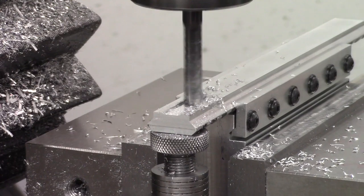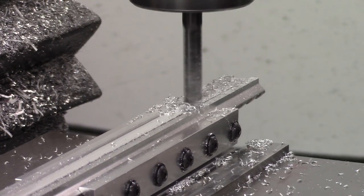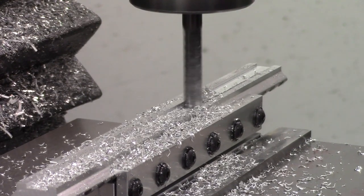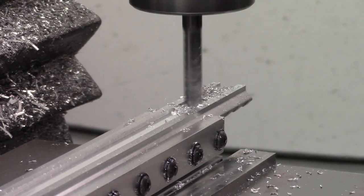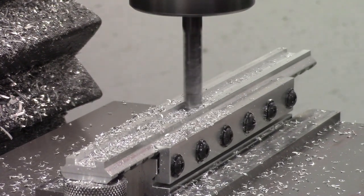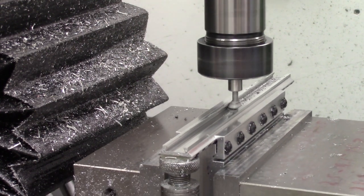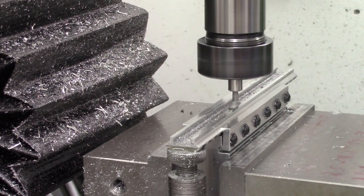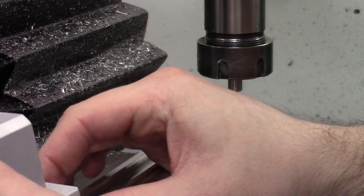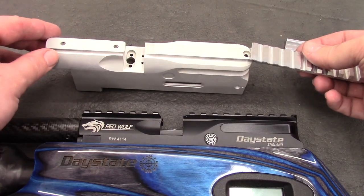Back on with the build — once the pick rail's to height we've got to mill a slot out for the dovetail to go in. This slot corresponds to the smallest part of the dovetail and we're going to be using a 60 degree dovetail cutter just to go along the sides cutting out the dovetail to the right width. Since we've got the block we're just going to be checking the fit of the dovetail against the block. You can measure dovetails using pin gauges and such, but since we've got the block it's quite easy to check the fit against the dovetail directly. So the first operation is to take the bulk of the material just with a standard end mill, and then we're going to come back with a dovetail cutter cleaning up the sides and getting it to the width of the dovetail. Once the width's been established we can raise the cutter up and cut the bottom edge of the dovetail to get it to size, and once it's finished and cut to height we can just about get the block on. With a dovetail in this application we really do want a nice tight fit — if you can slide the dovetail on and off easily it's too loose.